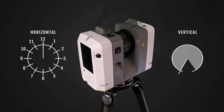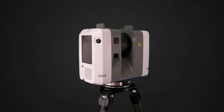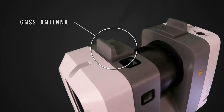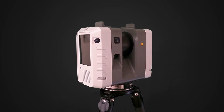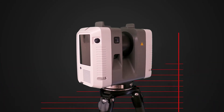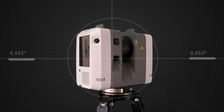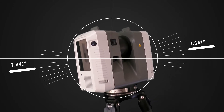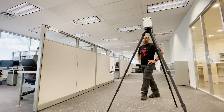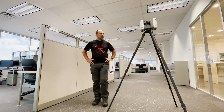This scanner is packed with extra sensors for better understanding of its position, rotation, and tilt. First, the GNSS antenna provides positioning information from satellites in the sky. Second, the RTC 360 has a compass so we always know where north is. Third, there's an altimeter that records elevation changes, and finally there's an IMU for understanding any tilt of the scanner, which means the scanner can be used in any direction as long as it stays still when scanning. The combination of each of these sensors contributes important information to understand the position of the scanner in 3D space.